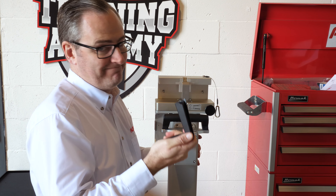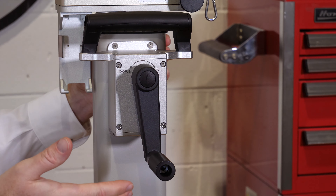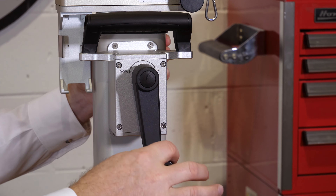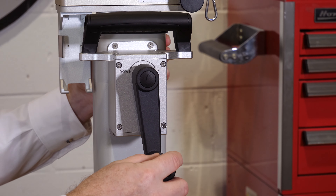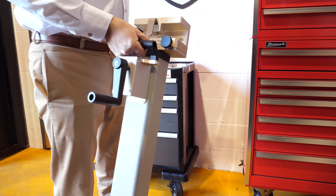On the rear of the MA600 you'll notice two distinct pieces: the lift handle and the crank. They are very different and should not be used interchangeably. If you lift the frame by the crank it will break, and this is not something we cover under warranty. So remember, always lift and store using the lift handle.